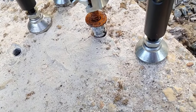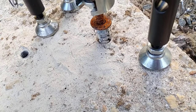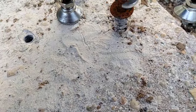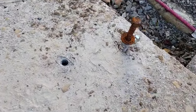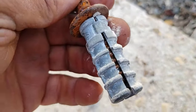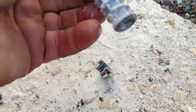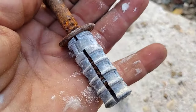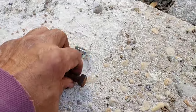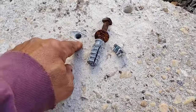So here it is, already failed. It's nothing. You can see the shield and how it's expanded. But it's not much grip on that because, as you can see the powder — it's just not much. It did expand, but it just can't do much. It went all the way down to the bottom and we can see how far we went. Let me take this shield apart and use the bolt on this next one.